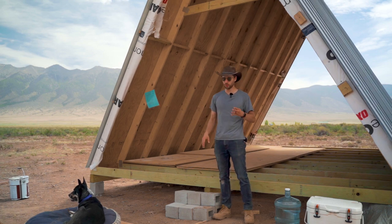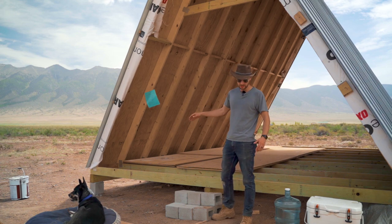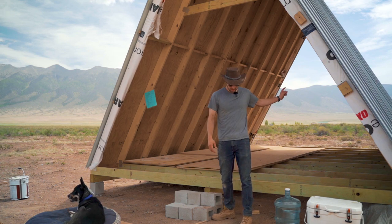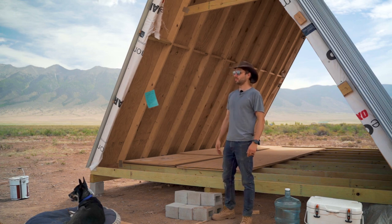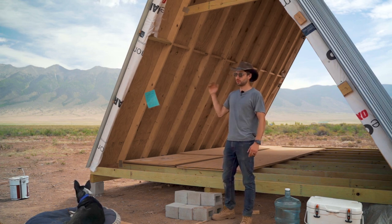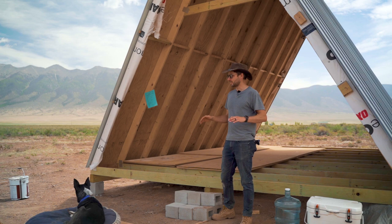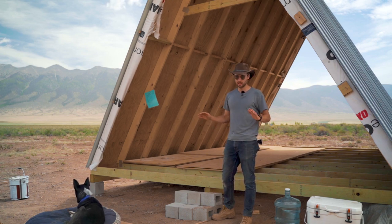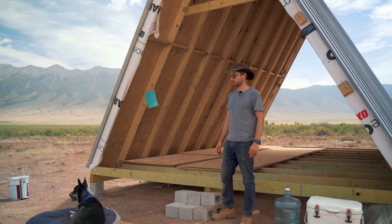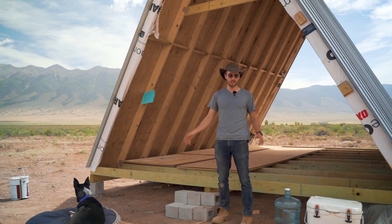What I'm hoping to do with the next four days out here is get the flooring put down, put up the end walls, windows and a door in the front — a double door. If I'm also able to sheathe it, wrap it, and put the siding on, that would be great. If I also get the siding stained, that would be a complete win. That would pretty much wrap up what I need to do here, aside from a few little odd jobs.